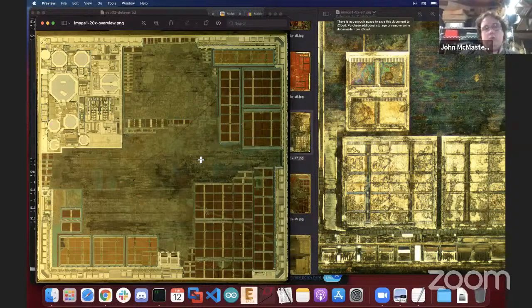On the other hand, RAM, SRAM, is a lot more common on the chip. Different buffers will use it, caches, that sort of stuff. So we also expect that type of memory to appear in more variety. And that's the other thing too here, from an entropy analysis standpoint. We have a lot of the darker type of memory block, and it's a lot less regular. We have a lot of different sizes there. And that to me suggests that it's a more common type of memory that's appearing a lot more on the chip. At least that's how I tend to look at it to identify it if I'm not familiar with this type of chip.